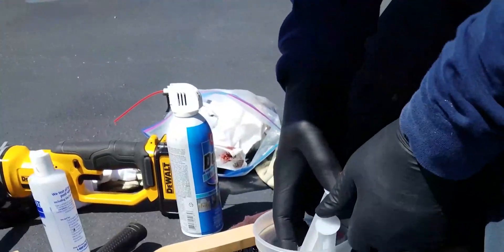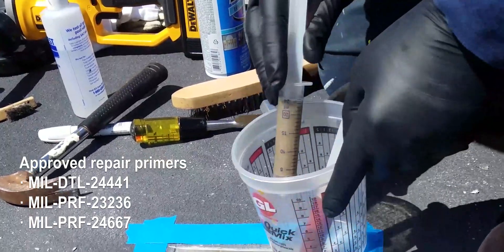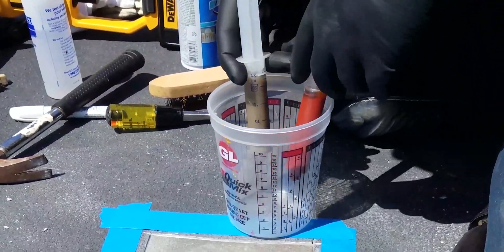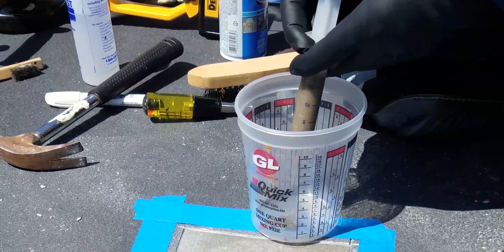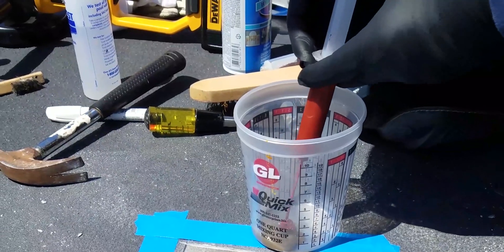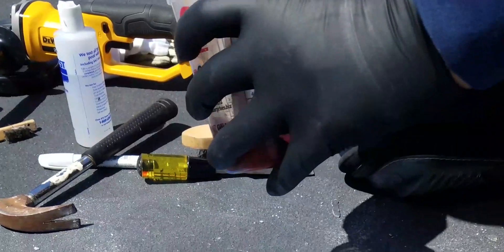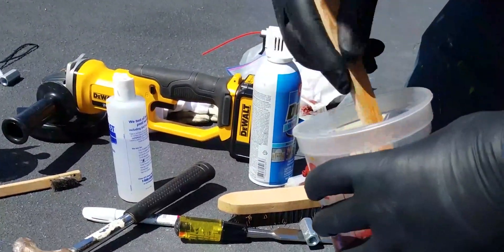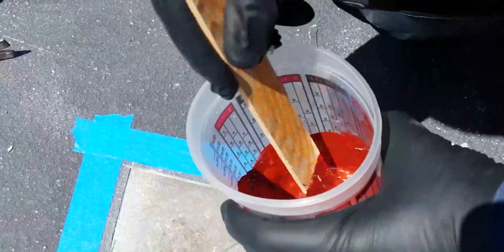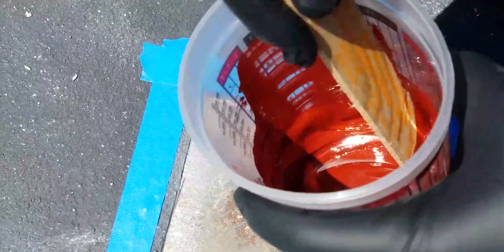We have mil-spec epoxy paint — this is MIL-P-24441, formula 156, one to one by volume. We pre-measured in little vials, but you can use a cup with measuring lines for one-to-one or two-to-one, whatever your paint is. Put the epoxy side in first using disposable syringes, then the pigmented side. Mix very vigorously — up and down, side to side, all the way around — until you get a nice, thorough, homogeneous mix. In a volume this small, you only need to mix for about a minute.